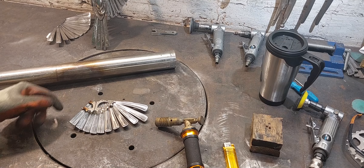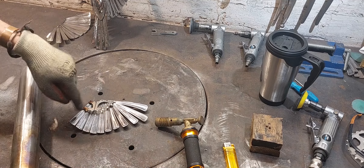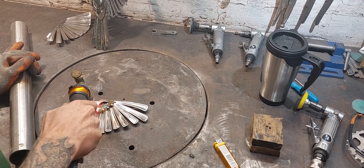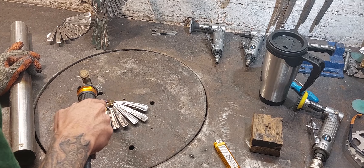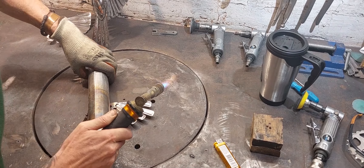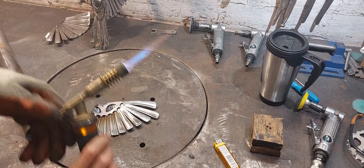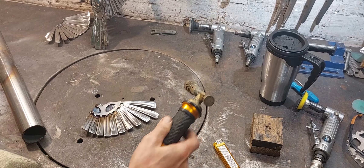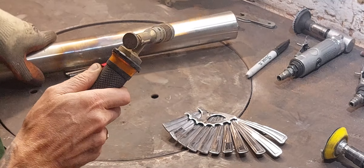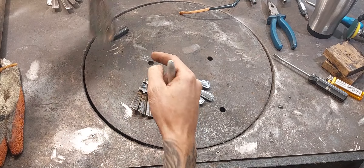What I've done is tack weld this cob to the edge. I'm going to heat this up with a blowtorch until it's red hot, and to avoid putting too many marks in it, I'm going to try pushing this rod down. If I push down in alignment with the feathers, that should create the perfect curve. That works really quite well. On the other bird I filled up this gap here with weld, so I'll do the same on this one.